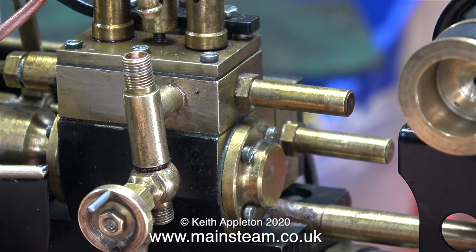Except that I've taken the safety valve from the cab apart, it's in the acid bath, and when that comes out of the acid bath I will reassemble it and set the pressure to 50 psi, and have made the owner of the engine aware of what could happen if the safety valve in the cab sticks again.